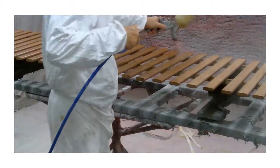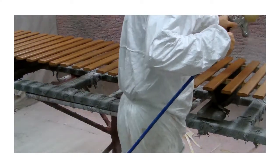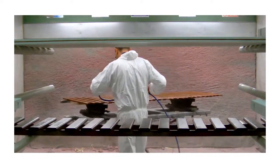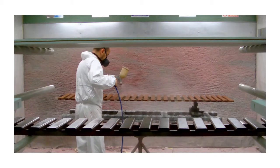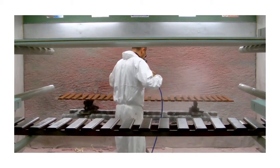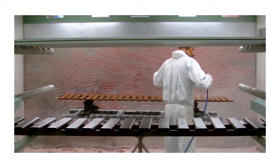The corners of the planks are rounded by hand from Okume panels and are treated with a primer to obtain the colour base. In a forced ventilation room the planks are placed on a cart and varnished with many coats of shiny acrylic paint. Colours and solvents used in the process are carefully monitored during preparation and application. The vapours are channeled into special filters and purified before being disposed of. Once dry, the planks are fixed to the holes previously created by the electronically driven drill.